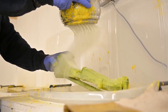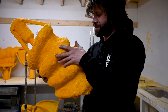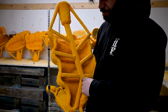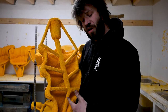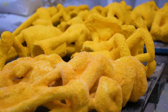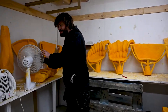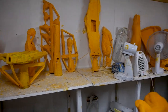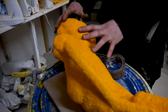So it gets dipped into the ceramic slurry then it comes over to your fused silicas. We've got three different grades — fine, medium, and coarse — and you're basically building up layers of ceramic to get your desired thickness on all of your shells. You can see all these running systems. In here is a wax covered in ceramic — this is your main pattern, and behind it is the system. Imagine the bronze travels down this gate into these outlets filling your sculpture, and then the air gets pushed up out of the vents so we don't get any airlocks and we get a 100% pure cast. We've also got fans blowing air onto the sculptures so all the pieces dehydrate — they go from this yellow colour and finally turn to this lovely golden orange, and when it's that colour we're ready to dip again.